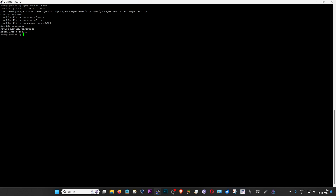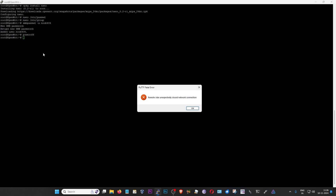But if you are running extroot on your router and want to use the same USB drive for the network drive as well, that would require repartitioning of the USB drive. In this video, I'm going to show you the steps to actually repartition the drive — to shrink the existing ext2 partition and create a new partition for a network drive. Before we do that, we'll have to power off our router because we're going to remove the USB drive that is currently connected in extroot mode. So I'm going to type 'poweroff' here and press enter. This will disconnect me from SSH. Now I'm going to unplug my USB drive from the OpenWrt router and plug it into my virtual machine that will be running GParted Live. I actually faced an issue while repartitioning on other distros like Lubuntu and Fedora, and the easiest fix was to use GParted Live — that's why I'm using it.